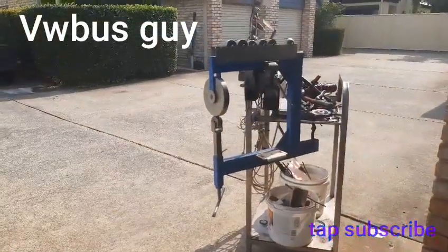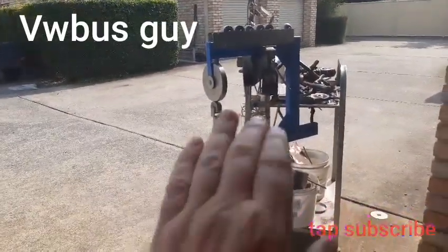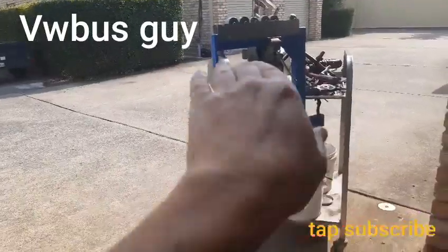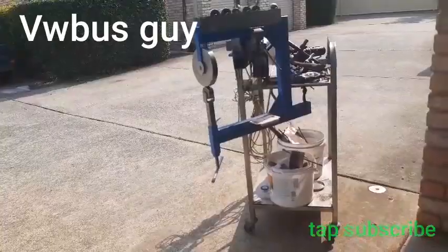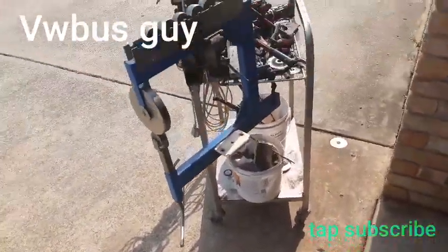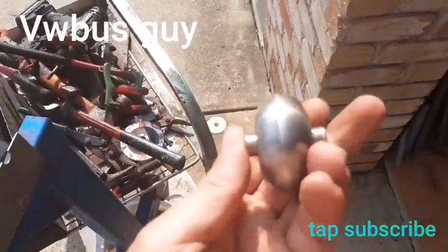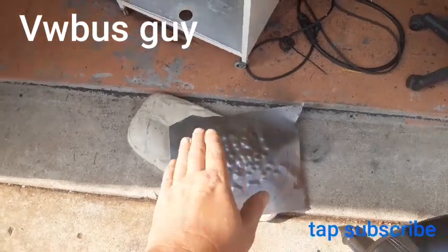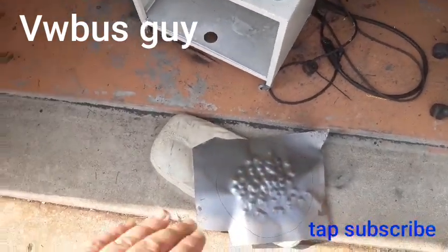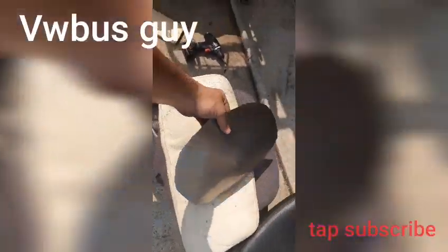I'll just work on my little wheel set up here and sort of work in a fashion like that with one of these high crown wheels that I've got. So that'll even out all the lumps and give me a little bit of a dome, and I'll bring it back. Okay, so I've cut forward a little bit.